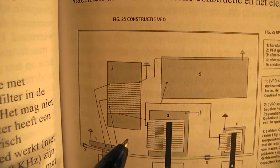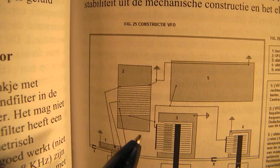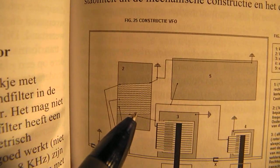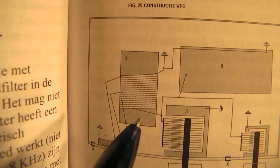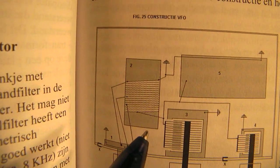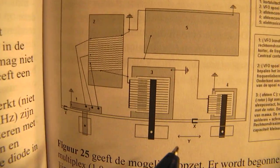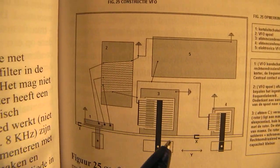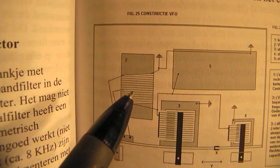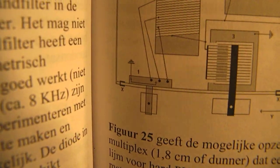The oscillator coil can be made in all kinds of ways — for instance on a PVC rod or on a cardboard rod. It's important to note that the quality factor of such a coil for a VFO must not be too high, because when the quality is too high you get a limited frequency band. This is in fact a broadband coil that, in combination with the capacitor as a tank circuit, must go broadband rather than be a high-Q coil.